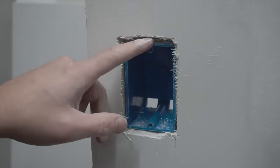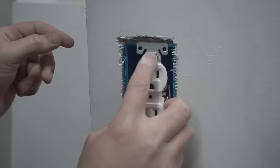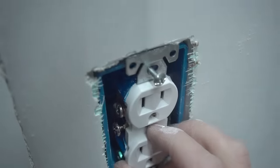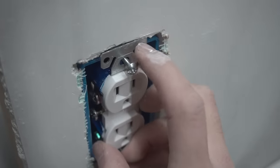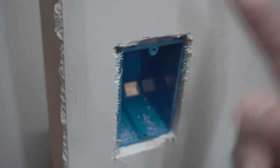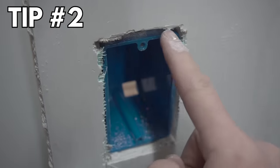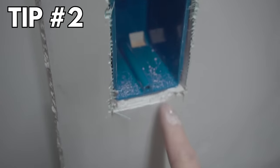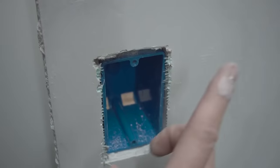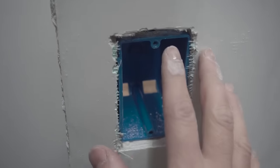Sometimes you have major damage from your drywall right here. I did this purposely — I actually damaged the top and bottom, made it a little bit wider. You can see these brackets sink deeper, right below the level of the drywall. The next way to fix this, which is tip number two, is building out the drywall itself from top to bottom. I made a video on how to fix drywall around an electrical outlet — I'll leave that video in the top right corner. It's fairly easy to do.